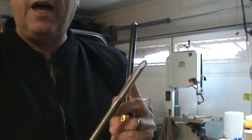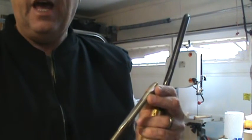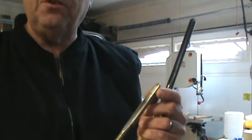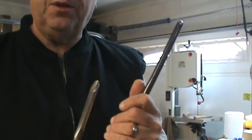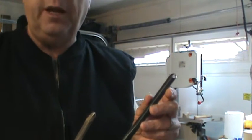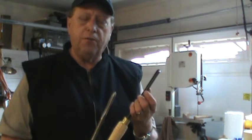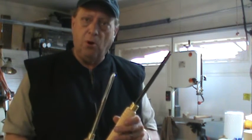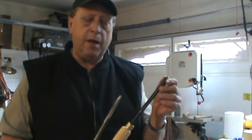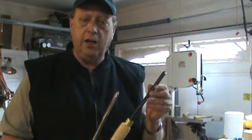Another difference is with a cheaper tool, when I'm rough-turning a green bowl, I'm going to the grinder pretty often to keep a nice, keen, sharp edge. But with Doug's, I'm finding I go to the grinder probably one-third as often. To me, that's important. Not only that, it's the quality of the edge — with this steel, I'm able to get a very, very fine edge. It is great tool steel.